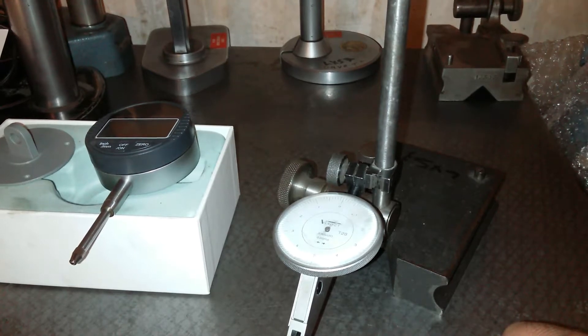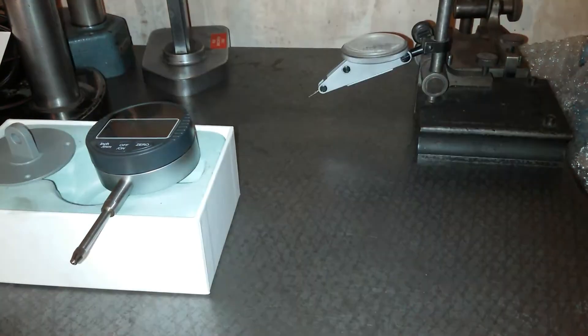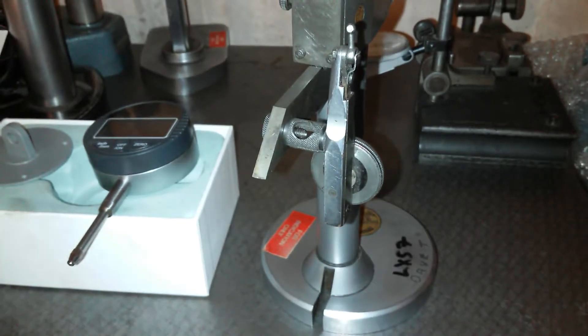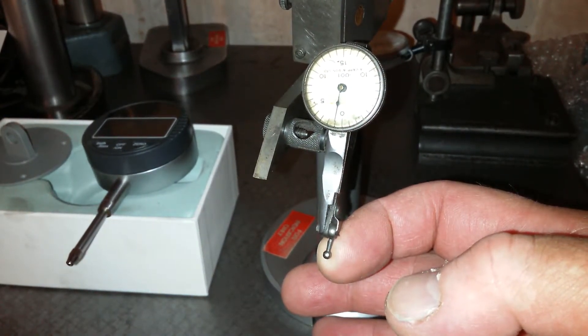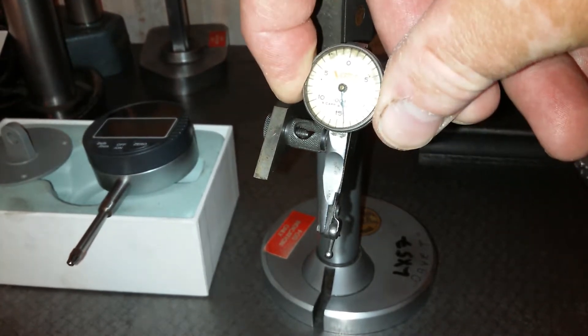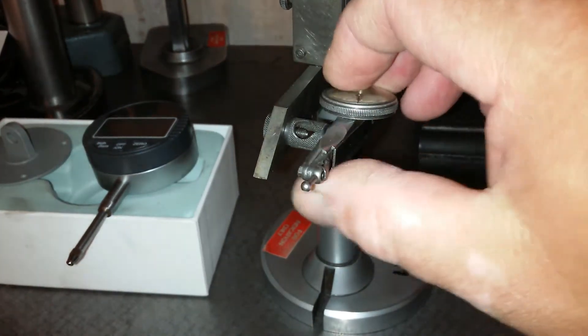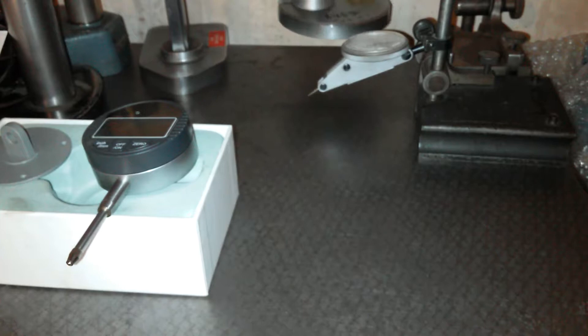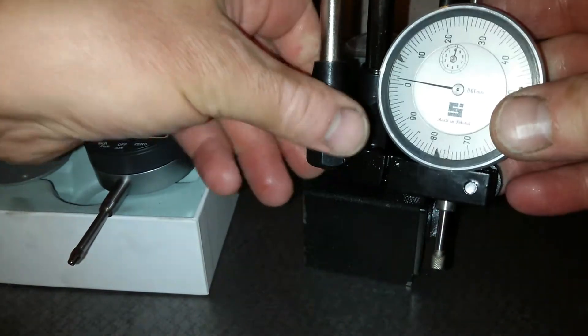You have to turn the bezel to zero it. Luckily this stand and gauge is unbelievably steady, and if you're quick you can see it move. You get a reading — that reading says two, but the reading around here says two as well. So there's a two here and a two there. You preload it, then turn the bezel around to halfway — like that — similar kind of thing. Turn it back around again.